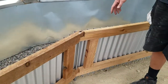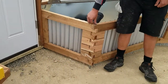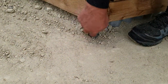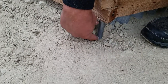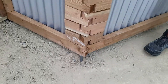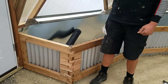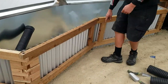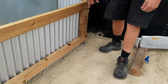Once those posts were in the ground, using our levels on each corner we decided what height we wanted the garden bed to be, and we had to cut little risers that sit here. Here's an example of one — there's a washer on top of the concrete, then a riser of three-quarter-inch EMT and another washer. We had to custom cut them to length so that, because the top of the concrete varies in height depending on how much you put in each hole, we ended up with a consistent level at that point on which to put the cedar for the walls.